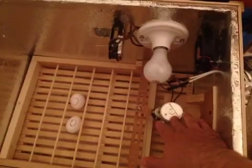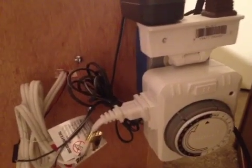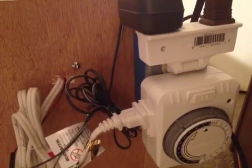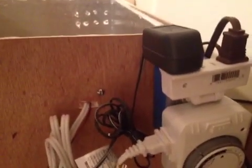To control the motor, I bought a timer — you can see it right here. I got this at Walmart for about $5 or $6. It has 15-minute intervals, so every 4 hours it will turn for 15 minutes. If you can find one with 5-minute intervals, that's even better. I have everything set up to a power outlet here, so I just have one power cord going to the outlet and everything else is connected here.